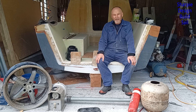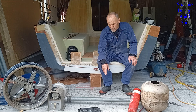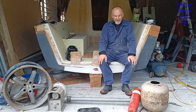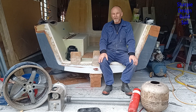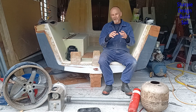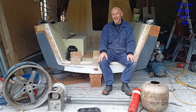Good morning — this is the second day of the project, it's Wednesday. Thanks Dave for giving me that mag wheel and three others that I'll cut up and turn into aluminium ingots, which I'll cast in a muffin tray — thanks Adrian for that. I have to turn the fire extinguisher into a crucible with a handle so it's safe to lift out and pour into the polystyrene foam moulds. This is the lost polystyrene foam casting method. All of this is to make bearing housings for the tabernacle so the mast can rotate. I think I've finally worked out how to design and build them.